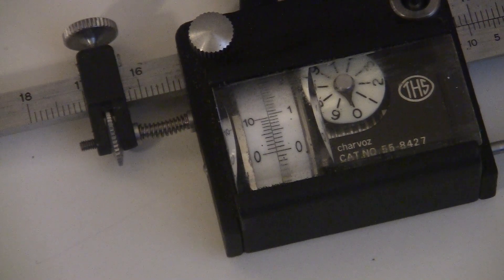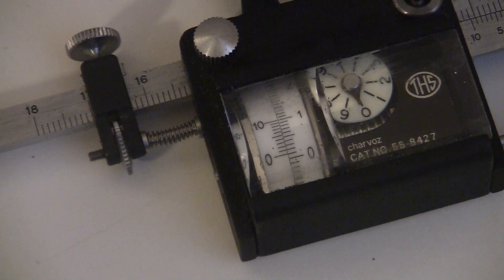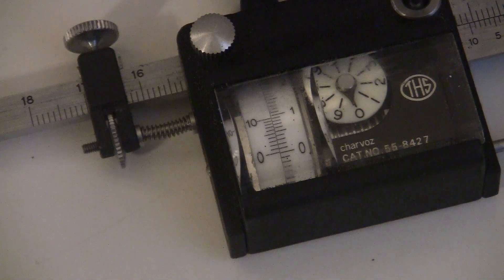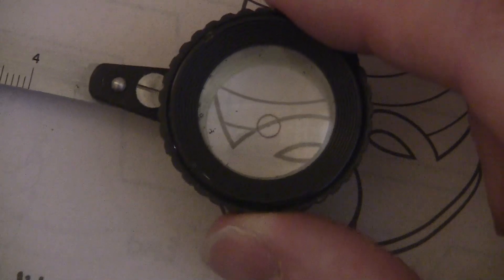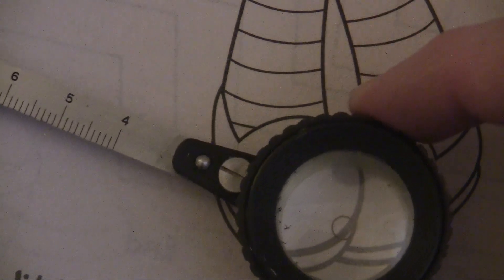There's another scale on the left of the wheel that goes from 0 to 10, but if you look carefully, you'll see it doesn't line up with the scale on the right. When you line up the zeros, the 10 on the left isn't aligned with the 1 on the right. This is called a vernier scale, and it's used for reading one more digit with good precision. You see this on old calipers too. This measurement here, if you look at the wheel, looks like 4.37 — the 7th mark on the left side is lined up with one of the marks on the right. This lets you measure with a lot of precision, but it's a bit silly for this device. Your hand is going to jiggle around quite a bit while you're tracing, and we've already seen it's not terribly accurate anyway. There's always going to be some error due to slipping and friction in the wheels, and the extra precision in this scale will always be far below the margin of error in your measurements.